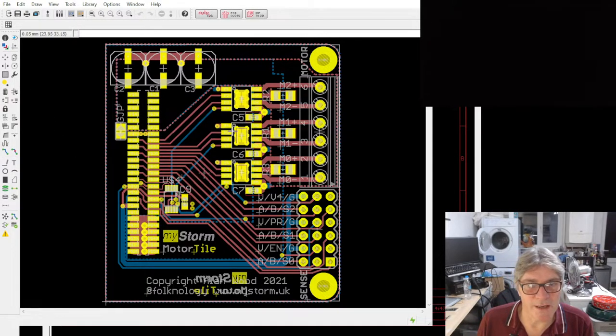And this will drive up to a maximum of 3.5 amps per coil or per motor, depending what sort of combination of motors you're putting in here. So in its configuration right now, you could drive 3 brushed DC motors, for example, each at up to 3.5 amps max, normally well below that. The current control is electronic. We have a DAC on board, that's what this device is. That sets the VREF on these for the current feedback, for the current foldback, the limit.